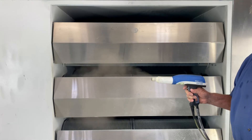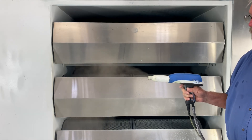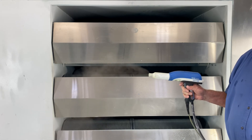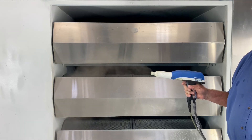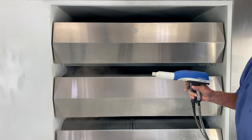This is what your spray pattern looks like with a 0.1 FM and 0.05 FS — a nice gentle flow. It may not look like a lot of powder, but with pulse power this is enough. You'll lay down powder very easily at this rate. Now we're going to take the gun up to 0.2 and show you double the powder flow.